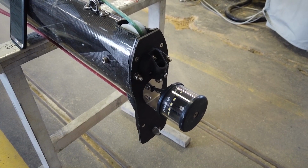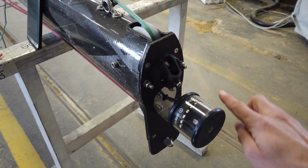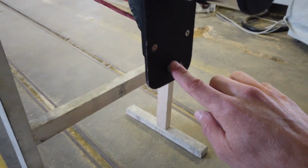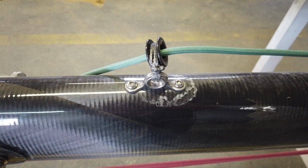There's not much yearly maintenance needed on the mast, but still there are a few points. Let's check them out. Top of the mast is heavily shaken, especially in stronger winds, so you can check that all of the screws are tight. Take a special look on the Windex base, which is also likely to loose.